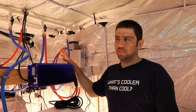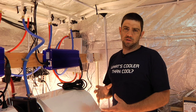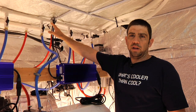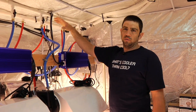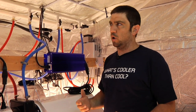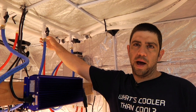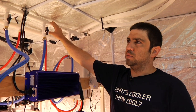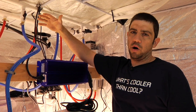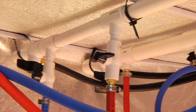Your manifolds are the heart of the system. You can daisy chain one or two ice boxes together, but a proper setup should use a distribution manifold system. You see we've got valves on each one of these supply lines — this is going to regulate the flow through your equipment. Some equipment you can run full bore with the water flow; some equipment you may want to turn back, like our nutrient reservoir cooler — you don't want it to be too cold. What we've done is we've got a one-inch line coming in and a one-and-a-quarter-inch line going back out, and that's really important. The reason is we want our manifold pressurized, which is what gives us even distribution through all the equipment, with no pressure on the backside. That's how the system works. These are properly set up manifolds.